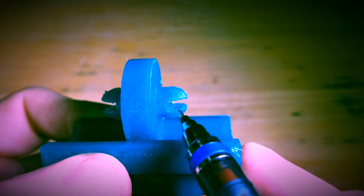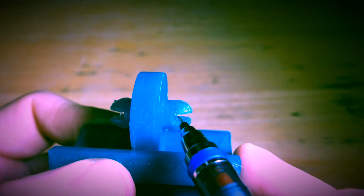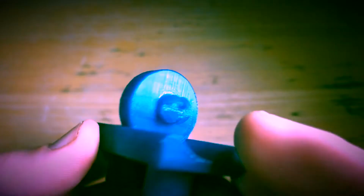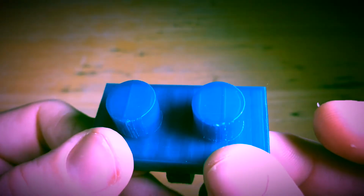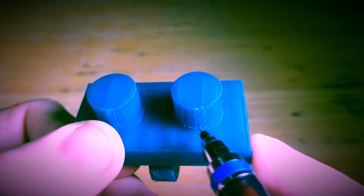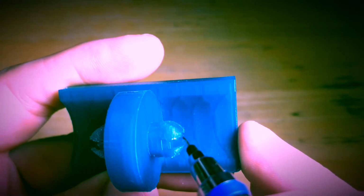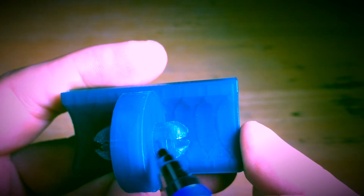So we printed it this direction, even though printing in this direction meant that this curve wasn't going to be as pretty, even though it meant that these pegs had to be printed with support. And that's all because of his priority in the strength. Which direction did he need that strength to come?